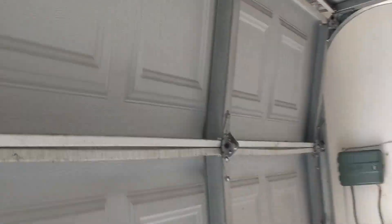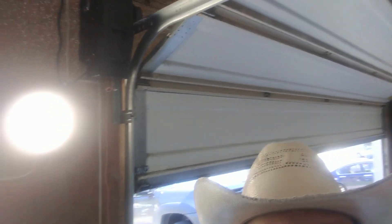Honestly, they're fine the way they are. But if it were me, especially once they plan on replacing the door, I would go with a 12 inch track radius. Even though this beam right here is obstructing, this beam to the structure of the home is not a hindrance when you go with a side-mounted garage door opener motor. That's one clear advantage of going with a wall mount garage door motor, and it's also an advantage of shortening the height of your door to accomplish that.